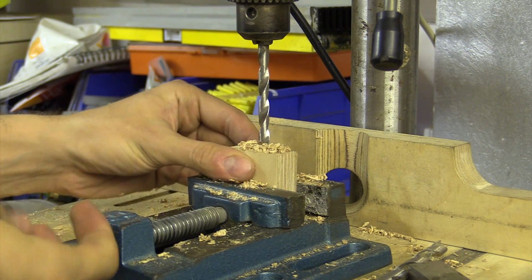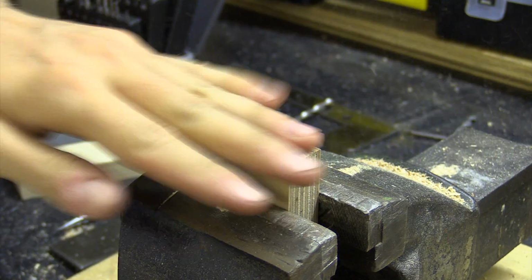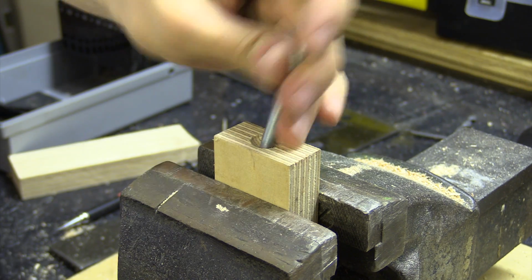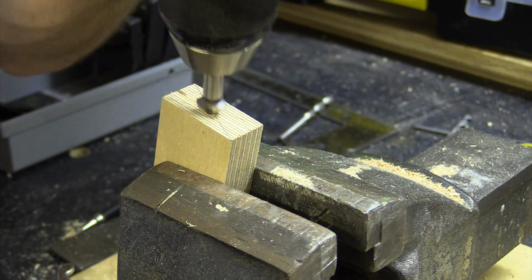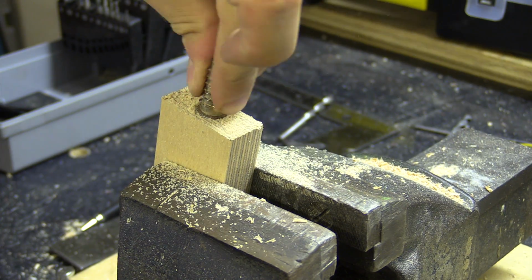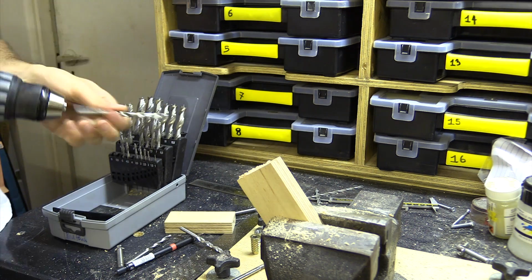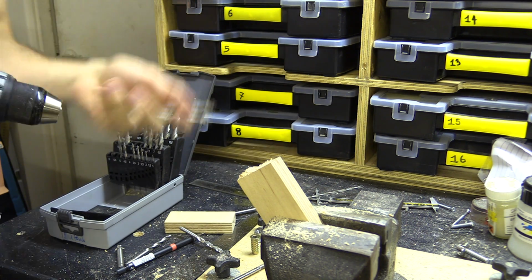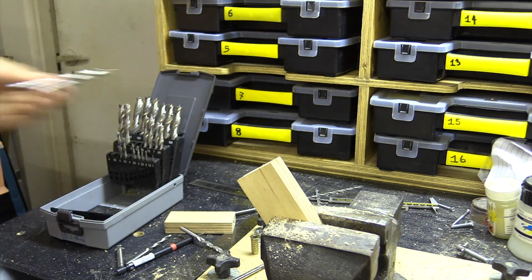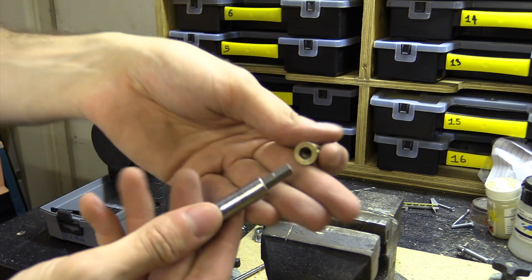After drilling the hole, I countersunk the space for the head so it would lie flush. It's a nice wide surface to push against the base of the mitre saw. I also countersunk the head of the insert nut on the opposite piece and progressively drilled the hole to the correct size. If it's too tight, it will split the ply when inserted. Anyway, here goes, the moment of truth.